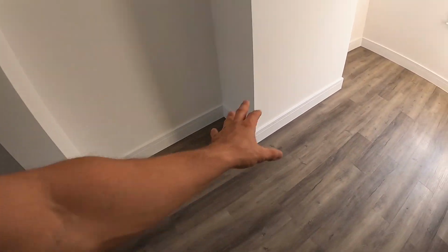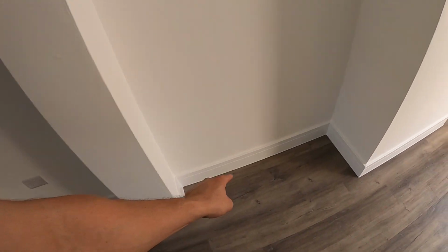Other thing is, with these little detailed areas, like you can see here, one piece which goes under the skirting, I had to be able to wiggle it slightly, so your glue wants to be slightly less tacky than you would normally have it on the big areas, because that's fine. On the big areas, what I used to do was a width of 5 rows, and that was plenty. By the time you put your glue on, you can start from the other end putting the flooring in, say 4 or 5 rows at a time. But with this bit, I would suggest you do it a bit after, because you'll have less time to work.